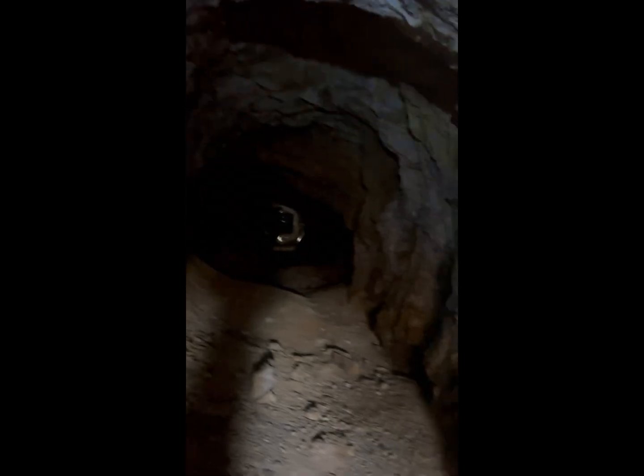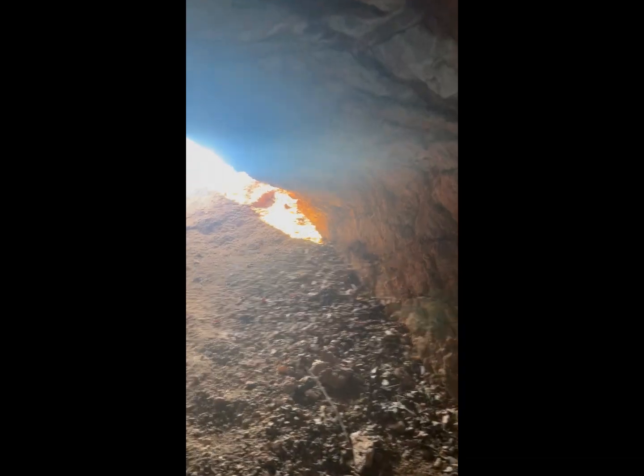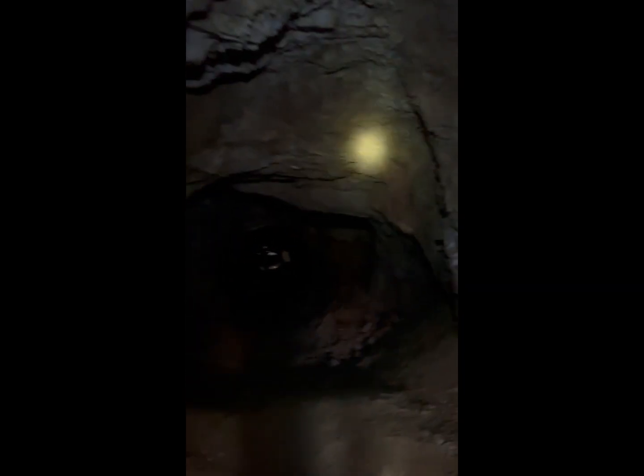Hopefully you'll be able to see. What we are going to do is we have some pegs that were done using a total station. We are going to follow through and mark the pegs which are on top — right now I can't see where we put them, but I'll put spray paint there so you will be able to see. We want to use those pegs as our controls for the survey we are going to do, so it will be easier to check if the scan is accurate enough for use in the underground environment.